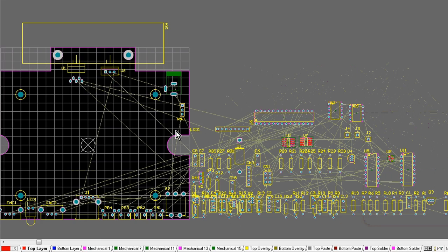And if you try and lay out an imperial board like this, instead of a metric board, which is what new surface mount components use, if you used a metric grid with imperial components, you're going to end up with the tracks not quite going through the center, and it's all going to get a bit messy.